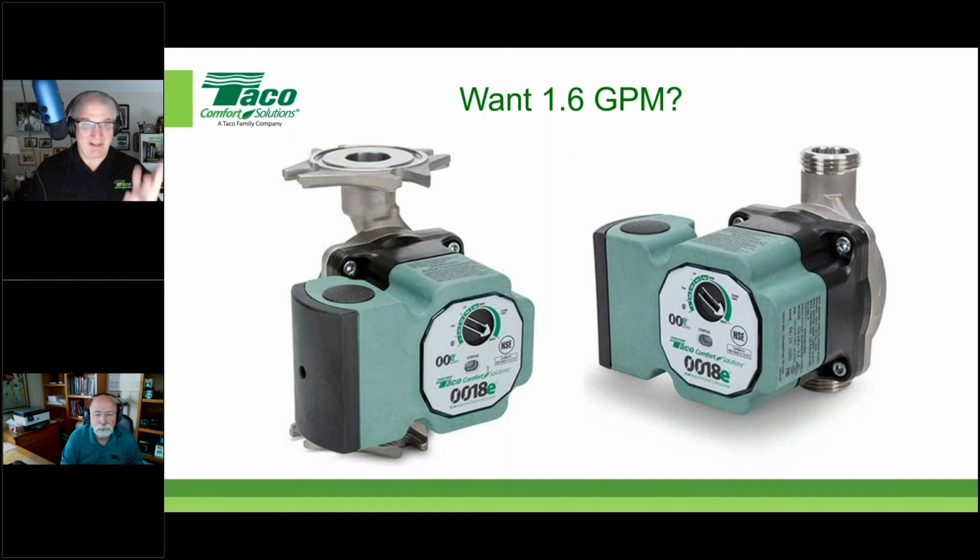I've had engineers tell me that pump has to be sized to deliver the hot water, the total load for all the fixture units combined. And he's got this base mounted monster for his DHW recirc pump. And I go, okay, you sign off on it, your baby, but boy, you're going to have to explain a sprinkler system in about six to 10 months, and buying pumps as they go out, because that's not a good place to run that pump either. Exactly. He's got a multitude of problems if he's doing that. So yeah, there you go.